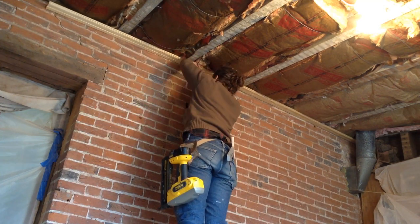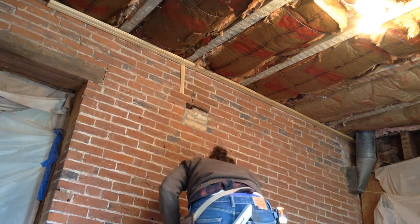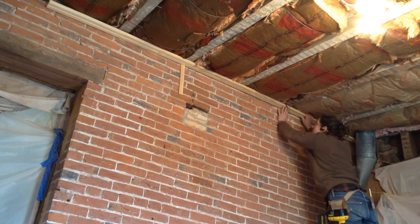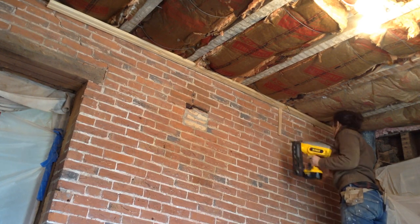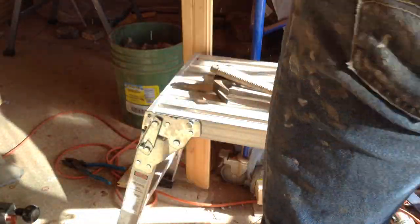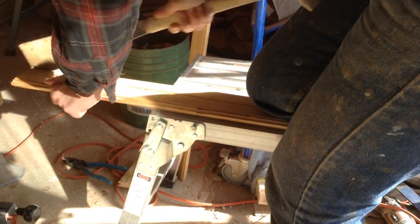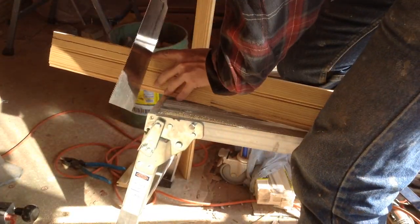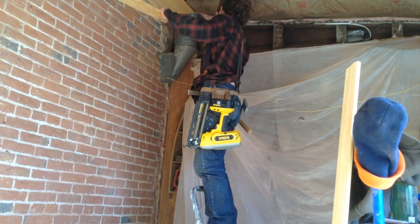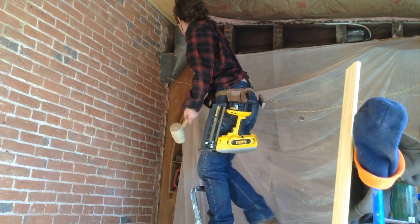Then beadboard was going up. I started with the far side of the room to make my life a little bit easier, shimmed out with shims to leave room for expansion. Since this was a one-person job it was a bit of a hassle, so I made two jigs to make it easier. There's no electrical in this video — my dad did the electrical and I knew he probably didn't want to be filmed. Also, electrical is one of those things where you get a lot of people lecturing you if it's not 100% to code, and that's hard to do in an older home. I'm also working around the vent in the corner — it's for the stove in the kitchen behind the wall, and I have a cool plan for a cover that might be a future video.